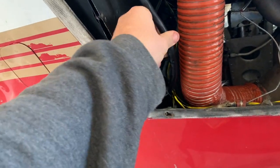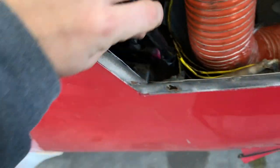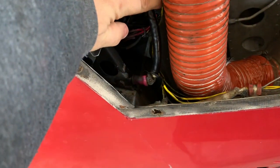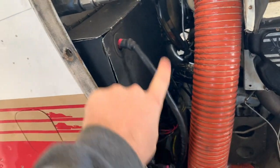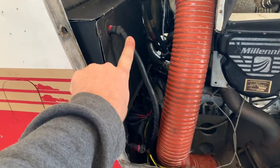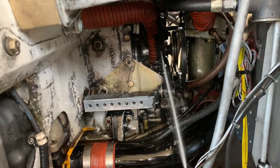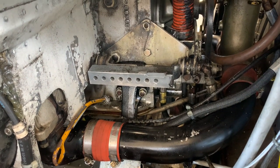When you move the wire back and forth to expose that opening, it probably separates some of the torn strands of wire — it goes from one ohm to 13 ohms, back and forth. So we're going to wind up replacing this cable and making it longer so it doesn't look like that. There are probably broken strands in there just covered by heat shrink.